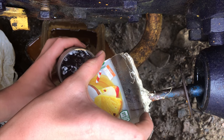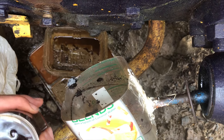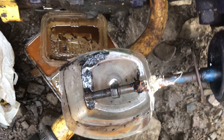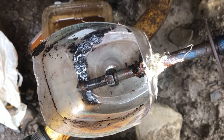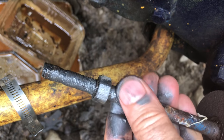If any of the parts aren't coming off, like this one bolt, just put it in for another day with the vinegar. I'd rather the vinegar do the work than me sit there and fight with it. Instead of throwing the old vinegar away, I'll put it into a peanut butter container and use it to eat rust off parts on another day. A little more soaking in the vinegar made a world of difference for this bolt.